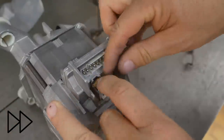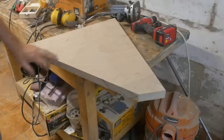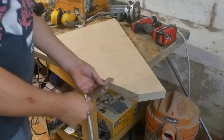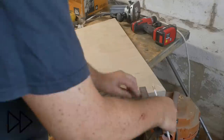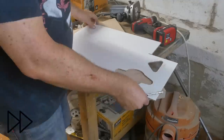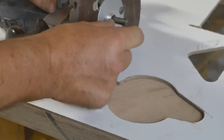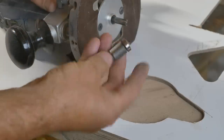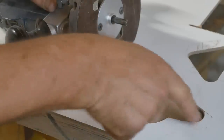While waiting for the new brushes, I can get on with the transmogrifier. I've got this piece of 35mm plywood left over from making stairs. We want about 30mm of meat around that cut out. Now this guided bit isn't long enough to go right through in one go, so I'll go in as far as I can and then come out from the other side with a piloted cutter and finish the cut, guiding it off the first contour.